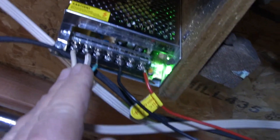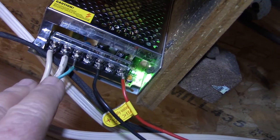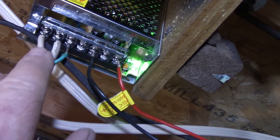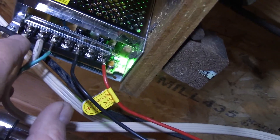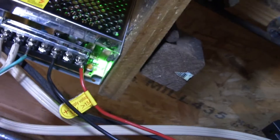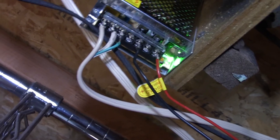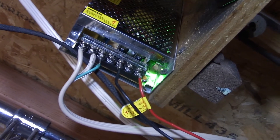Use a voltmeter continuity checker to make sure you get everything set up correctly from your cord. You can solder on the terminals, or you can simply solder a piece of wire, or just tin the end of your wire so it will go into the little terminal on it. Loosen the screw, slide it in, clamp it down, and you're good to go. Be careful that your wire isn't in a place where it's going to be hit or moved a lot, because that could cause a loose connection.